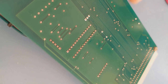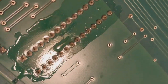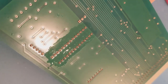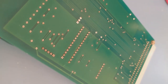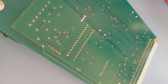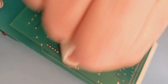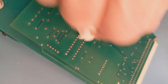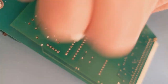As you can see I've got quite a lot of flux around this connector. Let's give it a zoom in — yeah, you can see a lot of flux around there. I normally go over this one a couple of times with a cloth, and I've got a little secret tool in a minute which, if you haven't seen before, you'll be pretty amazed at how good it is. So basically just dip a little bit of your cloth into the fluid. I'll try and keep my fingers out of the way because it's quite hard to do cleaning without blocking the camera. Just give the joints a gentle rub.